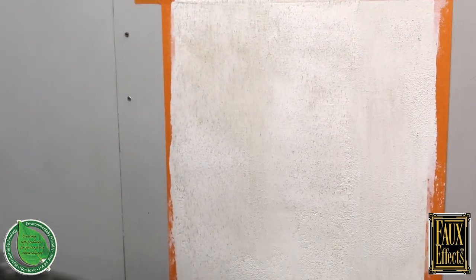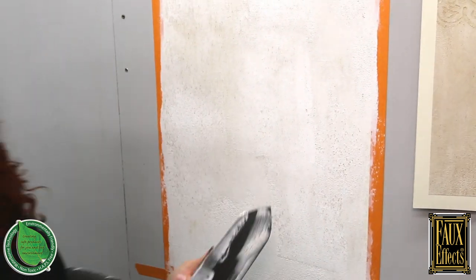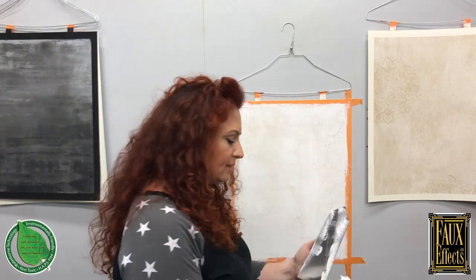This is also really good for a scratch coat. If you're dealing with faux stone techniques, or wanting to do a fireplace or a mantle and need to build up your base coat, you can thin down Sandstone about 25% and roll it on — it makes for a really quick scratch coat.